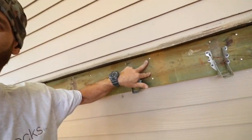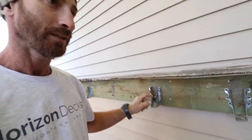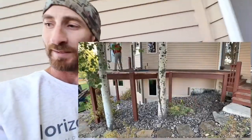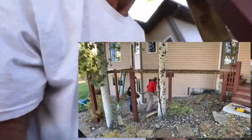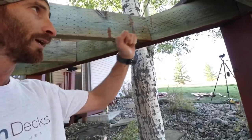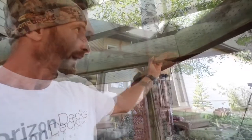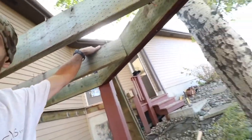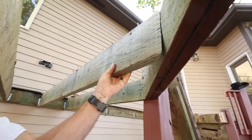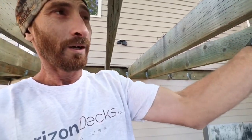Here's the current ledger and you can tell it was attached with nails only — not very good. Not uncommon to see on older decks, but it could be some kind of bolt or screw. Over here we also have the double 2x rim joist assembly, and that is nailed with nails as well. Not good. You can see the movement in it. That's why the deck was all crooked and leaning in all directions.